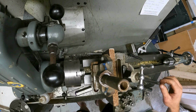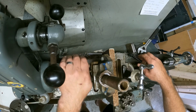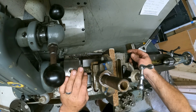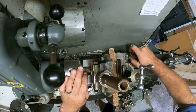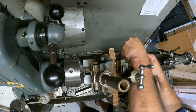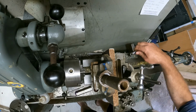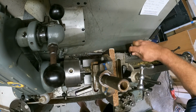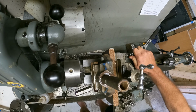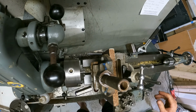Okay, so start up the motor, just see if it spins true. You always got to check your movement, check if it spins true, because you don't want to run it into the chuck or something in the chuck and damage it. It's just not worth it. Oh, come on. That's it. Lock my cross slide. The more you can lock everything off, the less chances there is of vibration, because where 2 surfaces aren't fixed together, you always get a bit of a vibration.